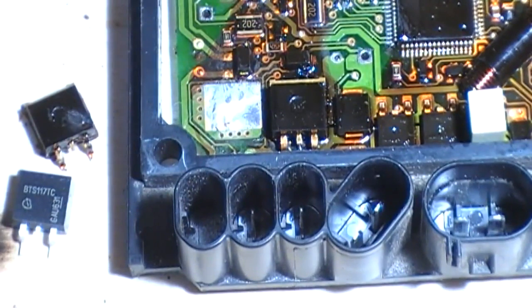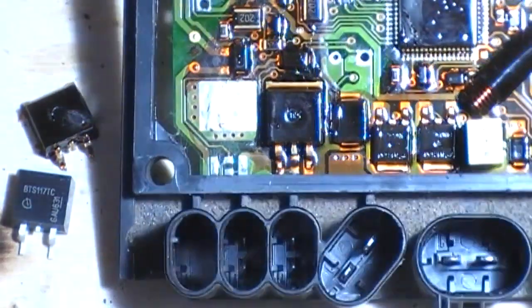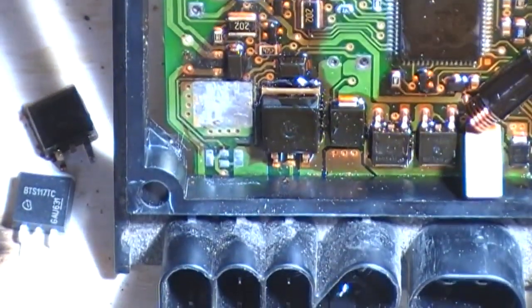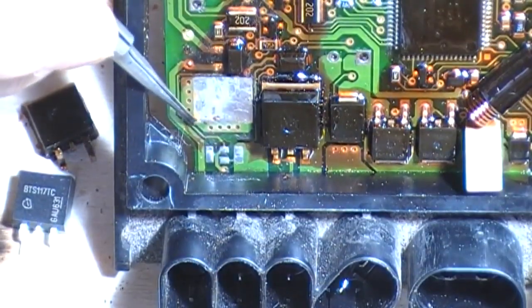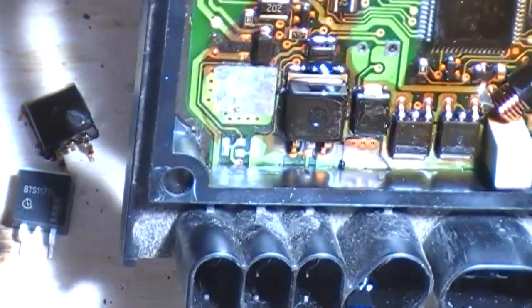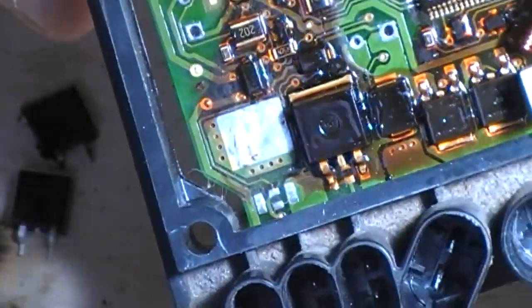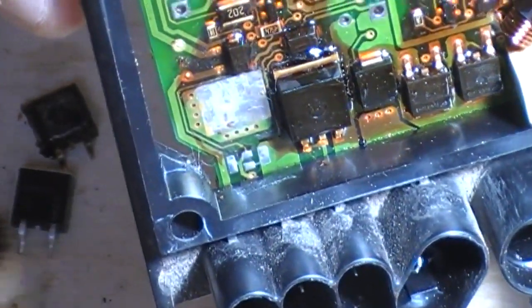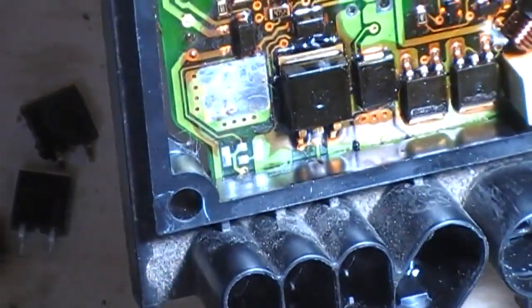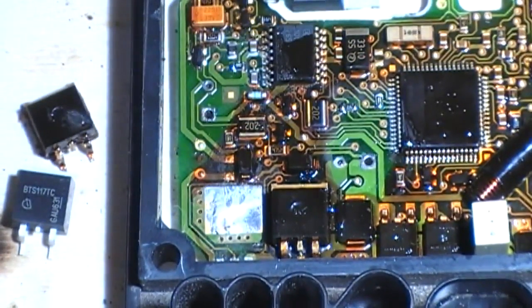Then I'm going to come in with the braid. I'm going to take up all that solder. I don't know if the camera can make it out, but let's see if I can get it in the right light. Sort of. You're going to have to squint your eyes, but here on the pad and here is still that goldy colour. Yeah, you can't. Maybe a little bit, but it's still that goldy colour, so it actually meant that in production it never fully got hot and fully wetted out. So we're going to change that.